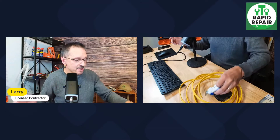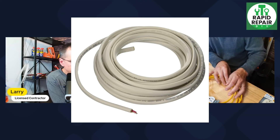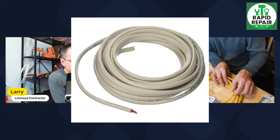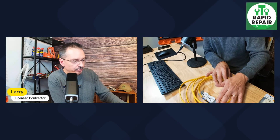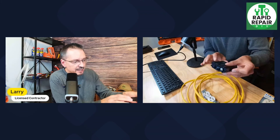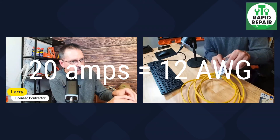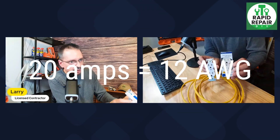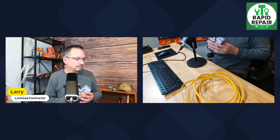Don't do it the other way around. If you have a 20 amp circuit and you use the thinner 14 gauge white wiring, your wiring will not be protected depending on how much amperage is being pulled through the circuit. The wiring needs to always — 100% of the time — match the rating of the circuit breaker. But the outlet? A 15 amp outlet on a 20 amp circuit — you are good to go. Good luck, you can do it yourself!